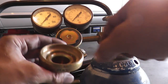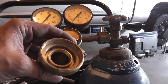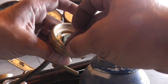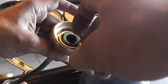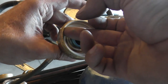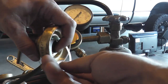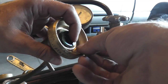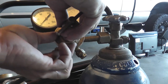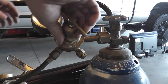There's a good look at the spring button. Remember, that nipple needs to go out and the spring just sits on top of that. Make sure you've got the slip ring in — do not forget that, because you will tear your rubber when you go to tighten it down and ruin your diaphragm. Make sure that little nylon slip ring or slip washer is in there.